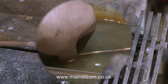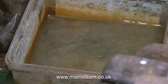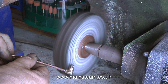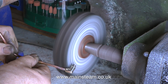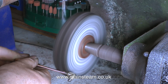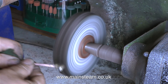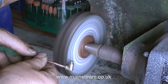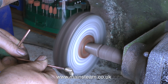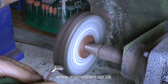The next thing to do is let the part cool to black and dip it in some cold water to cool it, then remove it. The thermal shock will remove some of the scale but not all of it. Usually I would put parts like this in my acid bath but my acid bath is in use at the moment, and it's hardly worth it anyway — I can clean this up on the polishing spindle perfectly fine. Sometimes you will find that silver solder flux forms a diamond-hard deposit on the metal. The acid bath removes this deposit, but without the acid bath I have to use a needle file to remove it before repolishing.